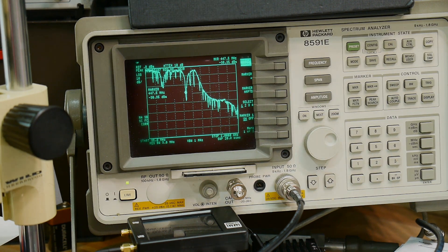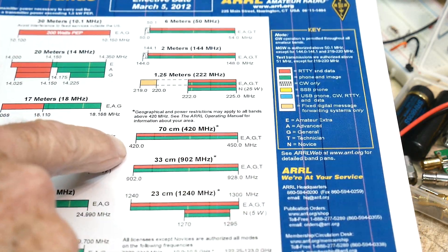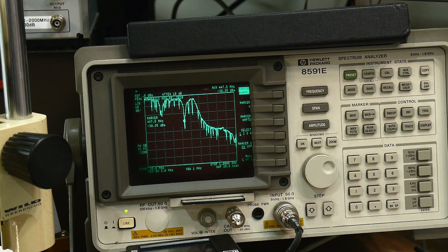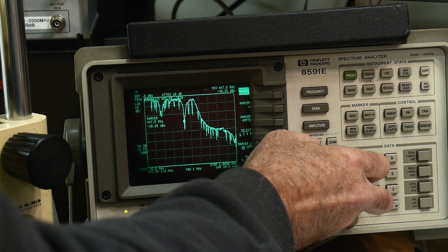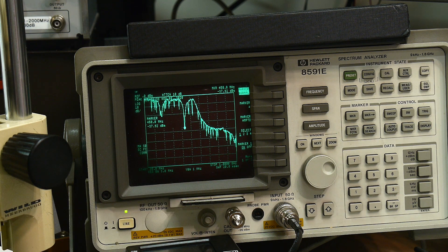Where's my frequency chart? All right, here's my trusty frequency chart. 440 goes between 420 and 450 — I didn't remember that. Okay, 420 and 450. Let's see here — there's 420, it's up there. So if we could do 420... and then 450 I think it's right at the very very bottom there. Yeah, 450 is right at the very very bottom so we go from great on the low side of the band to really really bad on the high side of the band. So we're gonna have to fiddle with the design there. At least we could try it on 420 and see if we can't get it to operate.